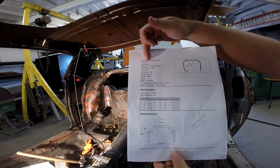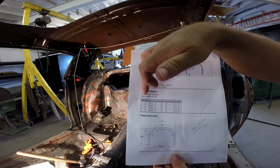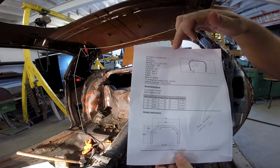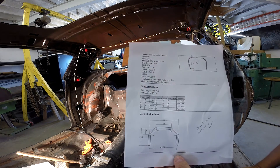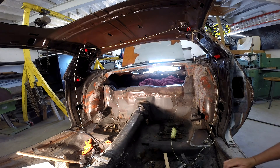So what it outputs then — you apply what tool you're going to use, what material, and all that — and then it gives you a bending formula like a recipe in which you can cut the length of your tube, measure for each bend, and then bend your roll bar hoop. Anyway, that's what I do that's different than what a lot of other people do. I hope maybe this helps you and gives you some ideas. If you've got an idea on how to do this that maybe works better, let me know — give me a comment. If you like this kind of stuff, hit like and subscribe and I'll see you on the next video. Thanks for watching.